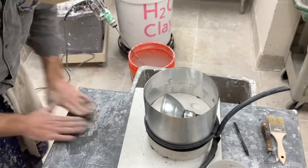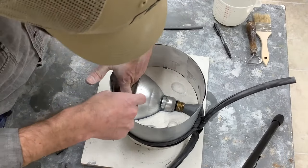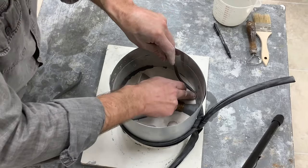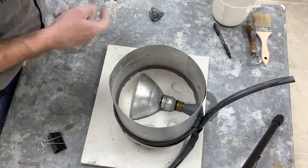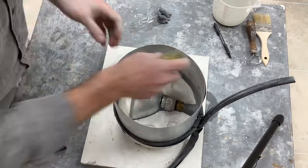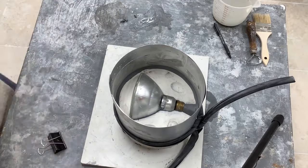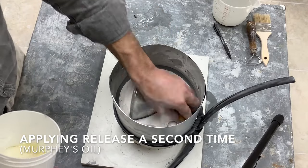The coils don't need to be very thick to be effective. Often people make very thick coils much larger than needed — it's really just essential that it fills the seam like a nice bead of caulk. Go back in with Murphy's Oil a second time to make sure the plaster and your object are both well soaked so that they will release later.